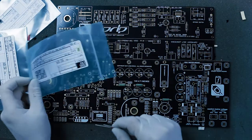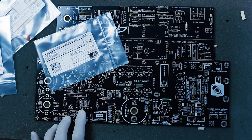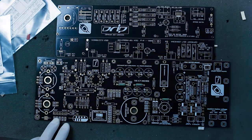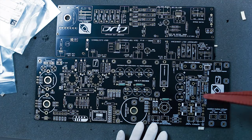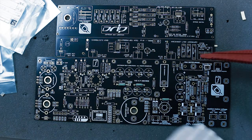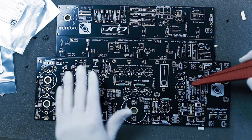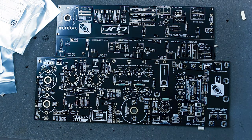Next item, 365 ohms. I'm using 365 for the 360 — R8 and R9. Next item, 470K resistors. The 470Ks for the most part will be bleeder resistors to drain. They also preload the circuit in some cases, like with the regulator — that means you wouldn't have to have the tubes in to set the regulator up. 470K would do it.